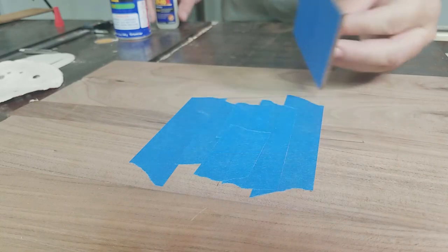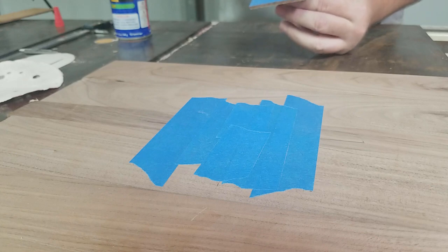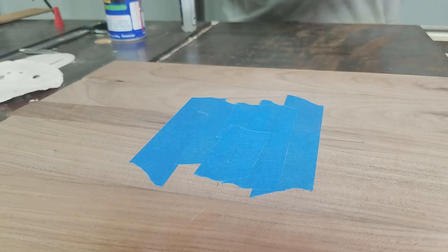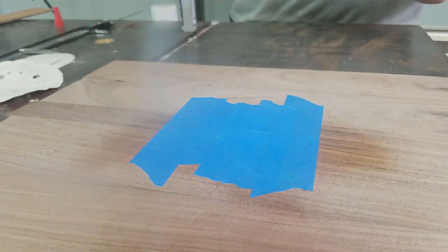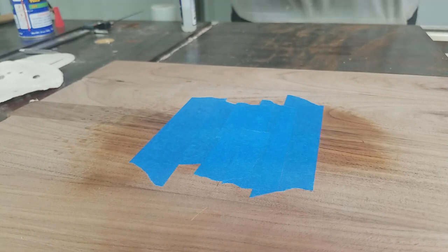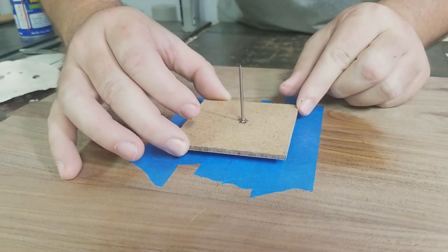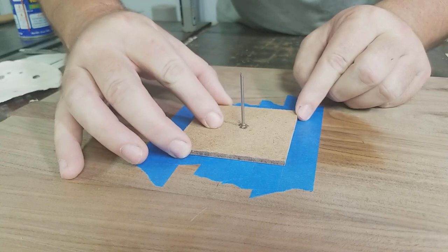The easiest way to do this would be with a CNC, but since I don't have one, I decided the next easiest thing to do would be to make a router trammel out of some scrap. I found a piece of hardboard and attached it to the router in place of the stock base plate. I drilled a hole 5.5 inches from the outside edge of the router bit, which is a 1/4 inch whiteside spiral bit, to give me an 11 inch OD circle.